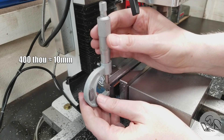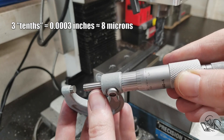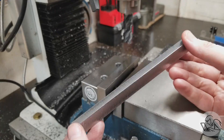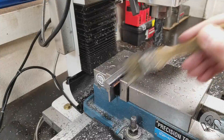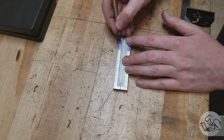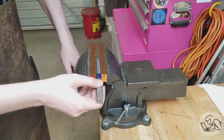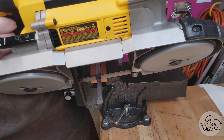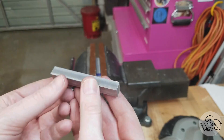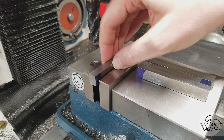I'm aiming for 400 thou — and that is YouTube perfect. On the honesty scale we're three-tenths over, so I'll take that. There's our blank after doing the remaining side — we haven't done the ends yet, but that's okay. Blank number one will have two jaws come out of it, and then I did all of that again for blank number two with the other two jaws. Now I'm going to split these apart to make four blanks, marking the rough center of each — I've got about half an inch of extra stock on both parts, so we don't need to be crazy precise. I'll chop those off with the portable bandsaw.